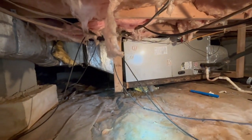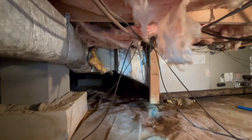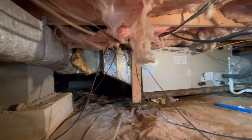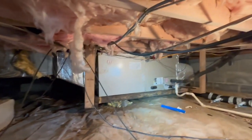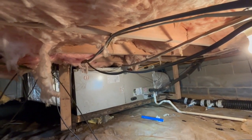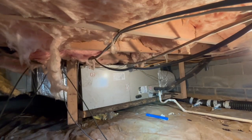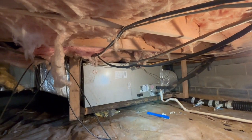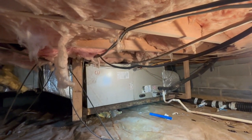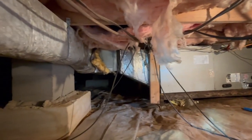I've got to fix the frame of it — that won't take a minute. I'm going to put the heat exchanger on the pressure side. Air handlers work very well with the heat exchanger on either side, but the disadvantage of having it on the return side is that the air handler itself has to operate at 170 degrees, which I'm not sure it's okay with.